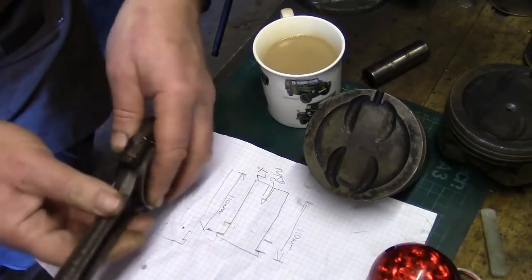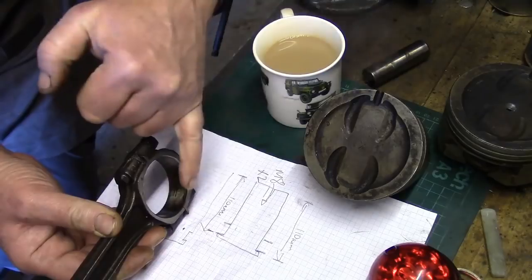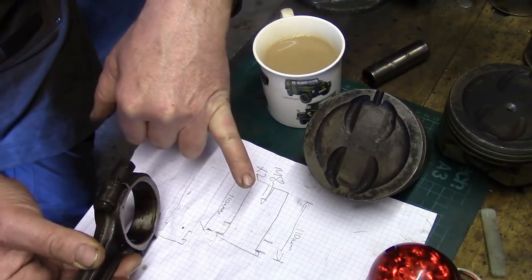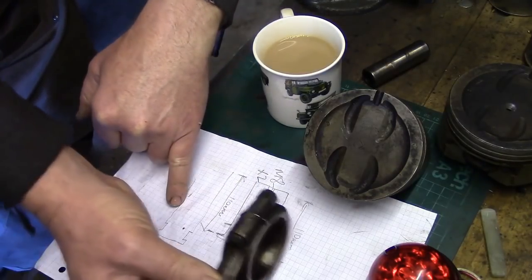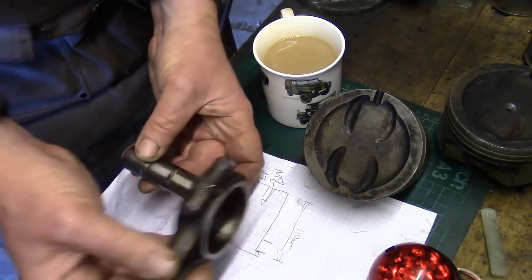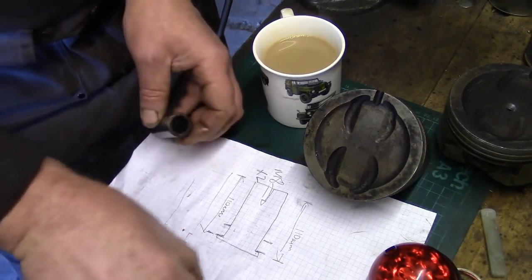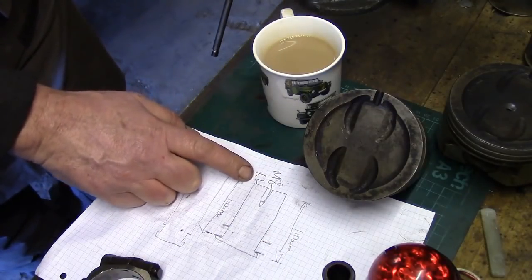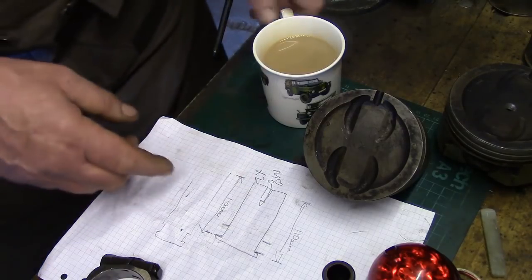So where this is going to be on the back of the pickup, I've got to machine a piece of bar that's going to fit in there, as he's got there on his drawing. Look, 110 mm long. Oh, I see, he's put a little flange on the end, so that'll slide along the bar. So if that's his piece of bar, obviously going to be a lot bigger. Let's just slide it on to hit a flange on this side, push up against there. What else has he got there? Two M8 holes. That must be just to mount it then.